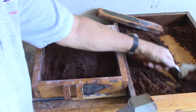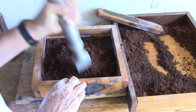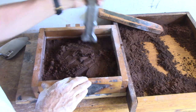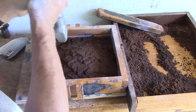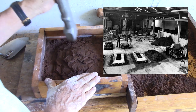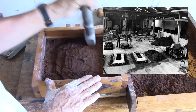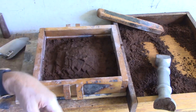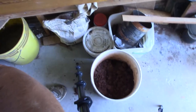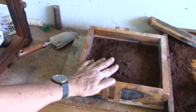A little more sand here. Once I get the pattern completely covered, then I can go to with the fine sand, then I can go to the bucket with just floor sand — that's what they called it in the foundry. The guys that did the sand were called sand crabs. The old sand crabs called it floor sand because the sand would just dump out on the floor and they'd sweep it up into a big pile. Floor sand is just filler to fill the rest of the mold up, get it even so you can flip it over.